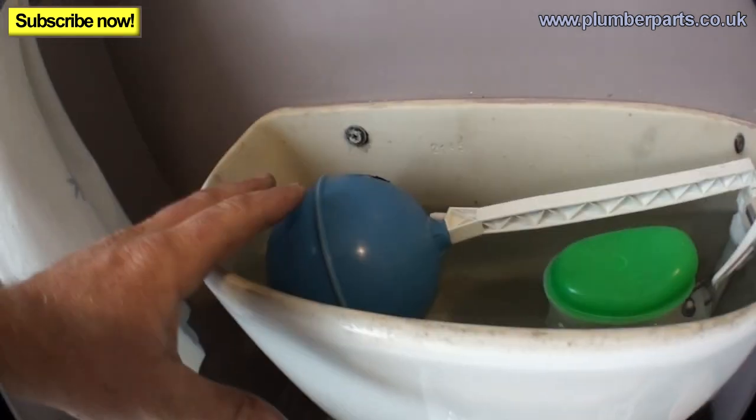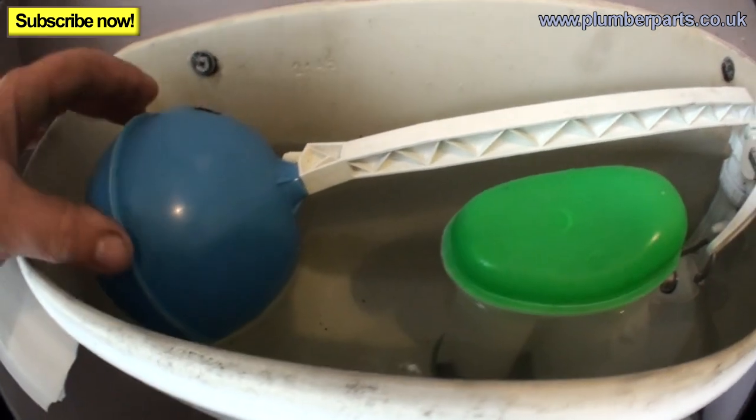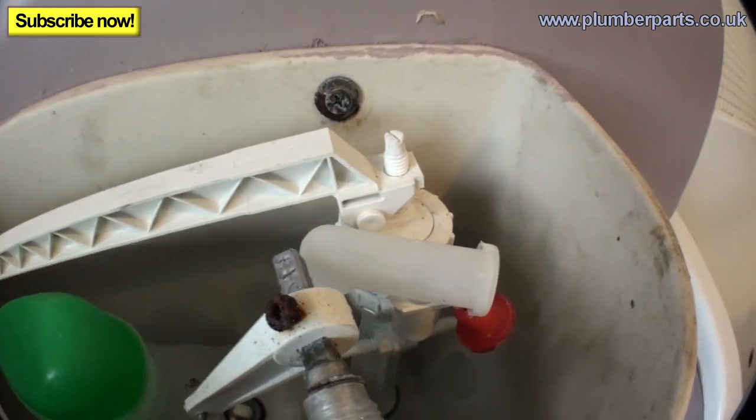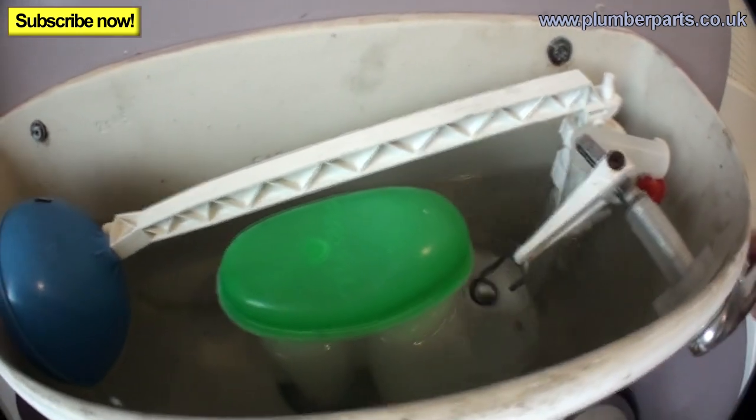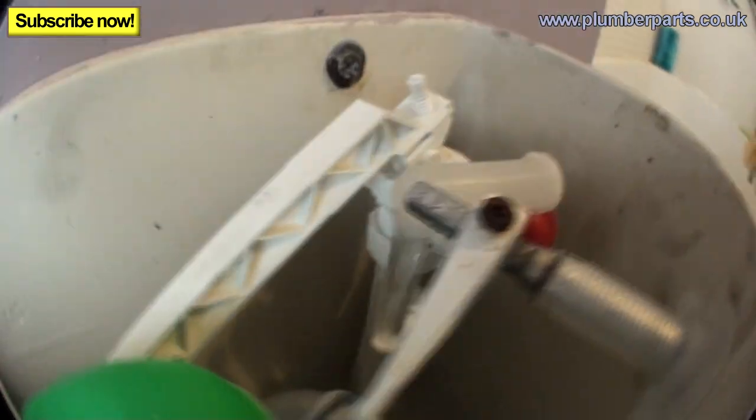So here is a ball valve. This is an airtight ball full of air. As the water rises up, this ball is pushed up and acts against the valve at this end. So if we flush this toilet, the ball drops and the water starts coming out. Now there are loads of different types of ball float valves out there. They all look roughly the same, though some have different ways. The one I just showed you is a bottom entry one - some just come in at the side. But they all work in the same way: they all have a ball float that, when the water level rises, lifts up and acts an arm against the valve to close it.